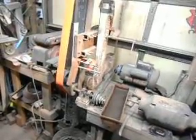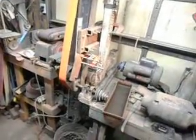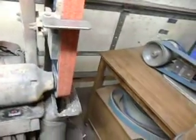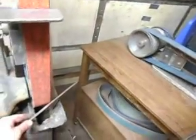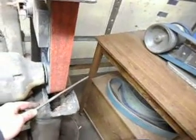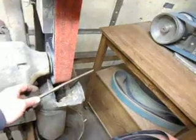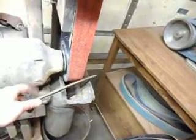I said, well, I'm going to have to be able to do some hollow grinding on that. I kind of doubt that I'm going to be able to do good fullers basically grinding like this, because that's where I normally do my full tang grinds to hollow out for the epoxy. So I got to thinking about it.